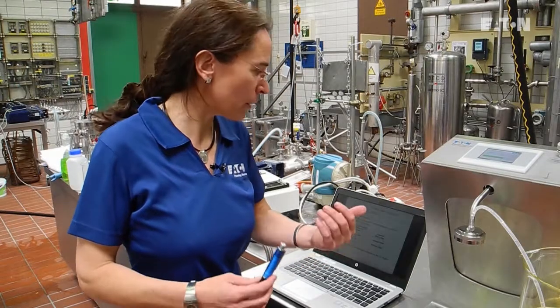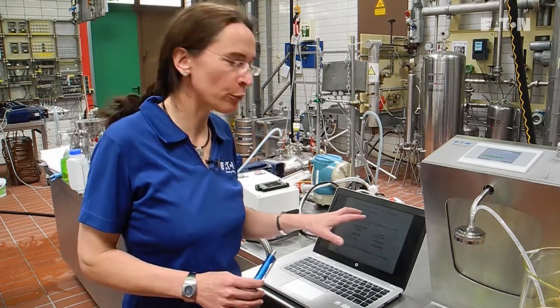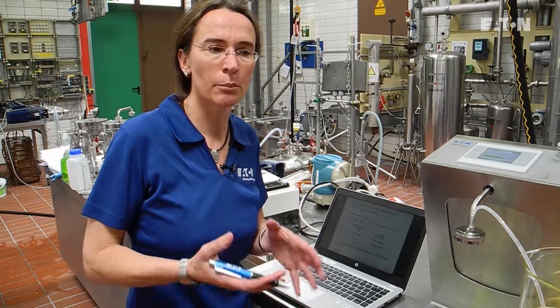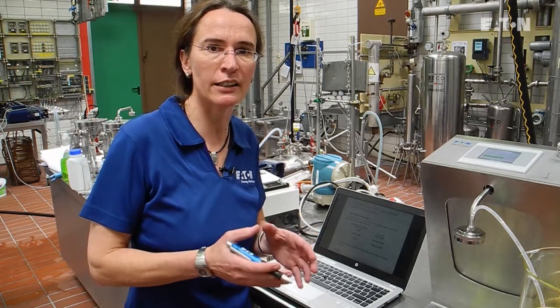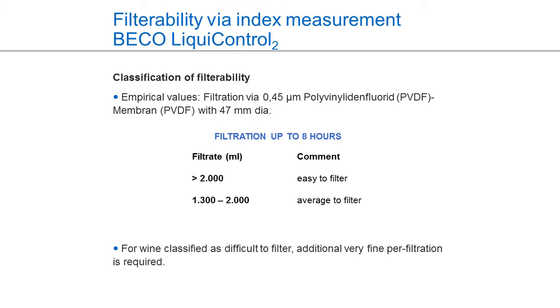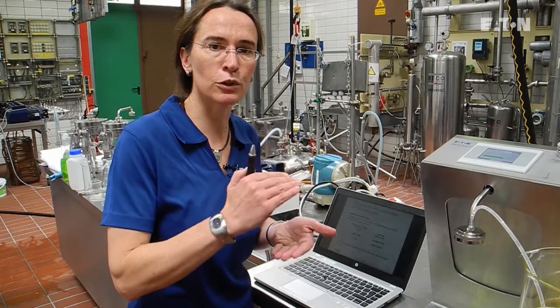The next topic is our practical experience with the equipment. If we have a winery that is filtering eight hours during a day, we recommend using three liters. Even though the winery may say it's a lot of volume, with the larger volume we get very precise and exact parameters and data. We recommend that if three liters are filtered and two liters pass through easily, we define it as easy to filter. Everything lower we define as average to filter or too difficult to filter. This gives the enologist an indication of how to adjust the filtration of the wine.